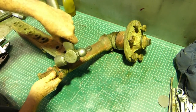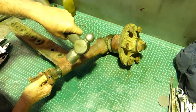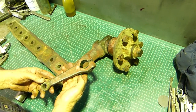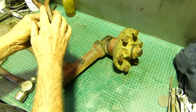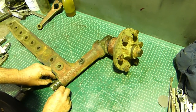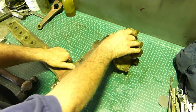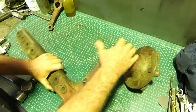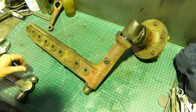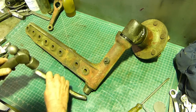We take the bolt away from the bell crank up the top here. The bell crank is what your tie rod end goes on to and they usually come off quite easily. I believe the left and right hand sides are the same as the keyways are in line with the arm on both of them. Once we have that out there's often a little felt up the top here but this one has a rubber.